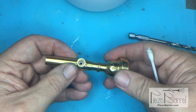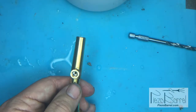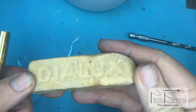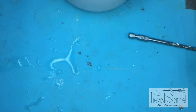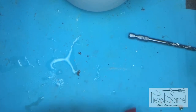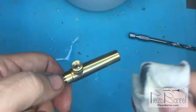There's a hole in the bottom, all nice and shiny — that's it, ready to use. We can do a final polish to get rid of any oxidation on the outside. For polishing I use a polishing compound — a stick of wax with a very fine abrasive embedded in it that does a little cut and polish. Just get a clean rag, put some of the wax on it, give it a rub. Areas where the metal's gone a bit red from the heat polish away quite quickly. You can see it going a bit black where I've rubbed, which indicates something's happening.